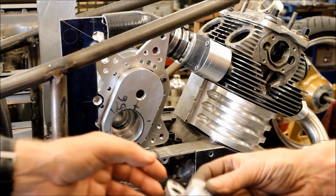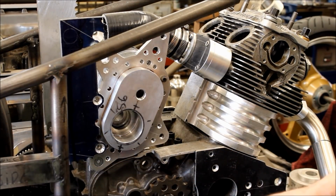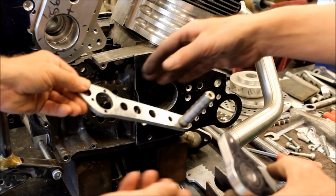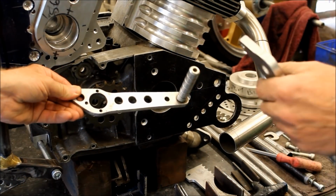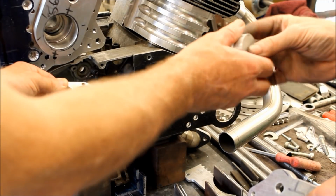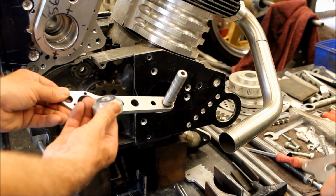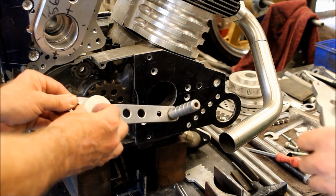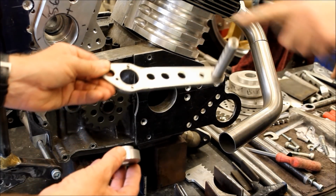those bits up, because these are going to be machined. Originally, that was an aluminium piece with a couple of screws on it, with a bit of grease on it. And it worked, but what I want to do now is put a bearing in them. So everything is very smooth. It is smooth. That goes in there like that. So they've got to be machined.